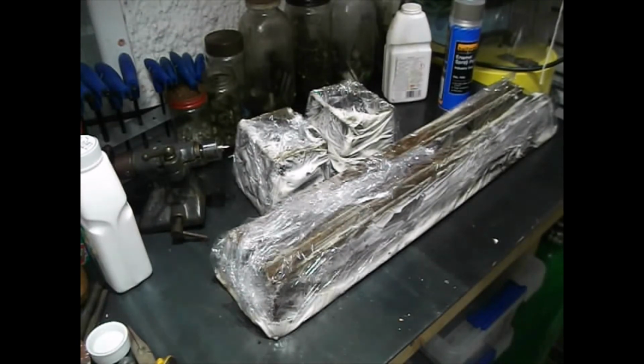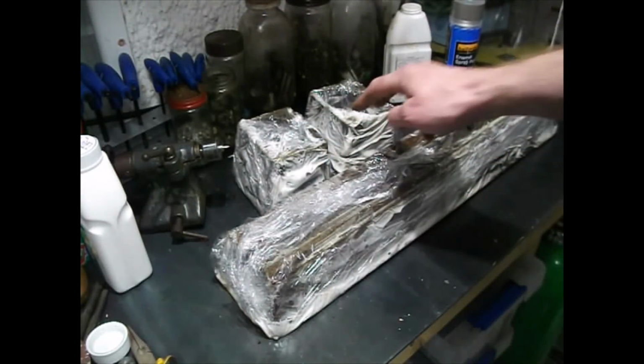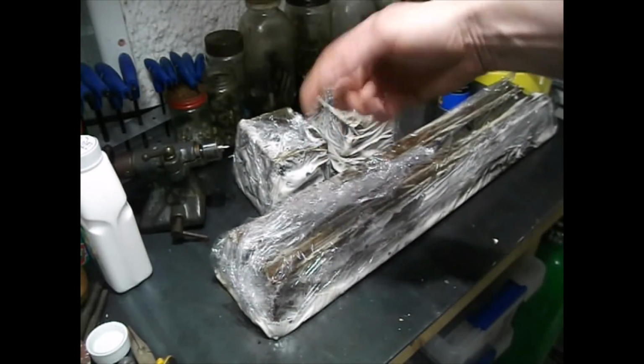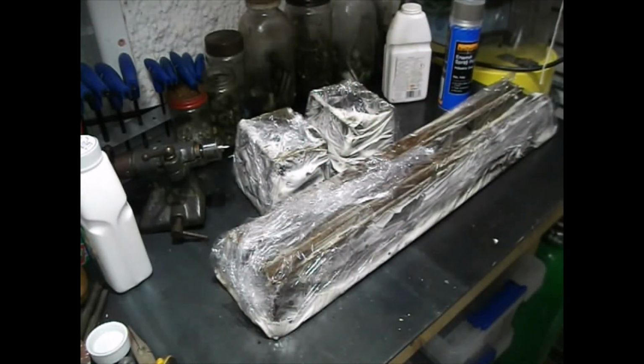Next few days I'm going to try and put out at least something on this restoration every day, so keep an eye out. A few jobs that I know I'm going to have to do. I'm going to have to do some manufacture of a few bolts, 3/8 Whitworth for a start off, in order to hold the feet onto the base plate, because I only have enough bolts to reassemble the feet onto the base, and the pulley holder as well onto the top. So yeah, a few jobs including taps and dies.